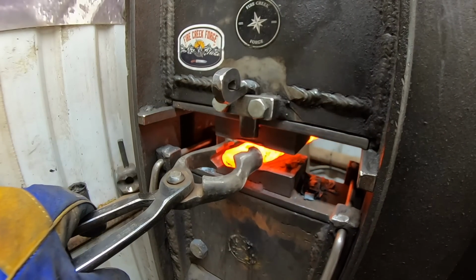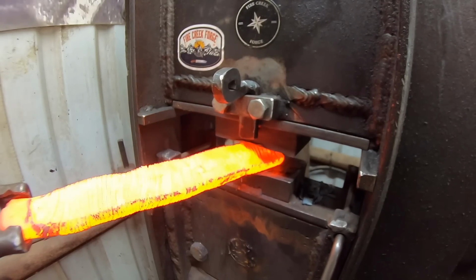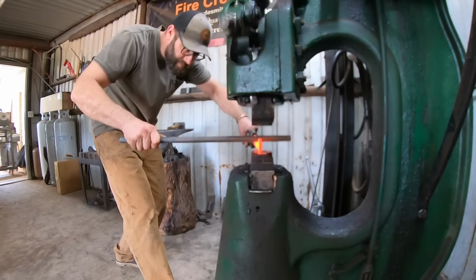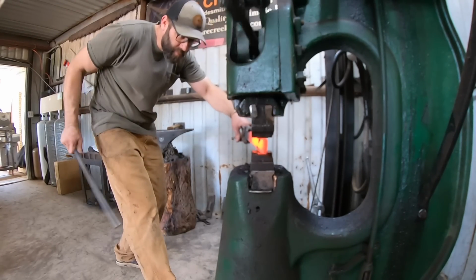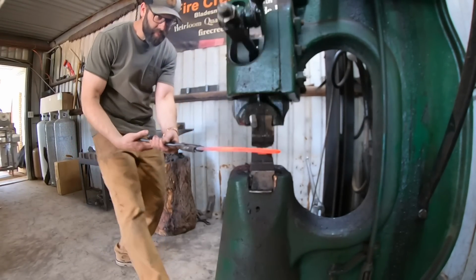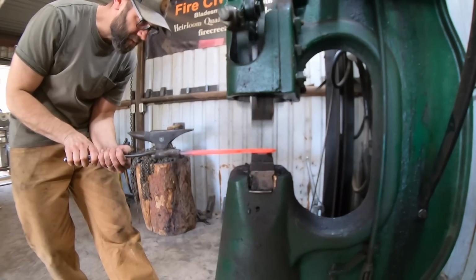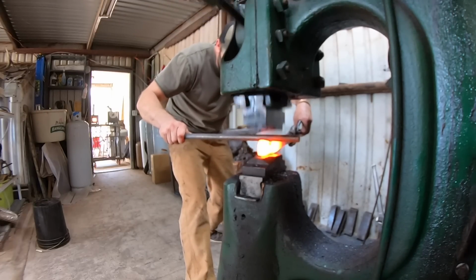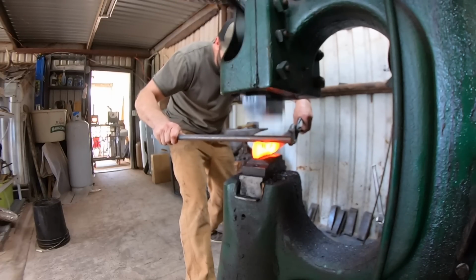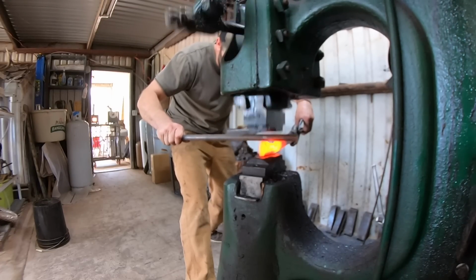Now this is something I ran into the last time I worked with a crushed W's pattern. That is the extensive surface inclusions, if you will, that open up on a crushed W's twisted billet. That's more so than typical with a twist pattern in my experience, and so you have to grind those out as you go and continue forward. They're always surface level, but you lose some of that outer pattern, unfortunately.